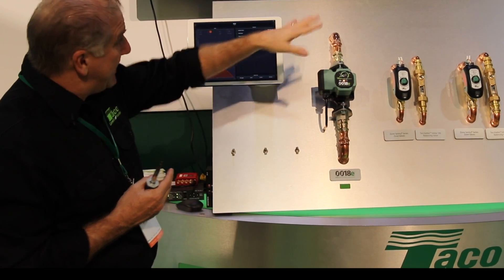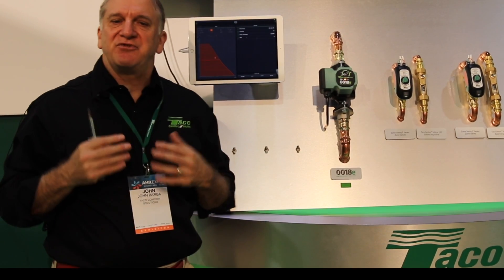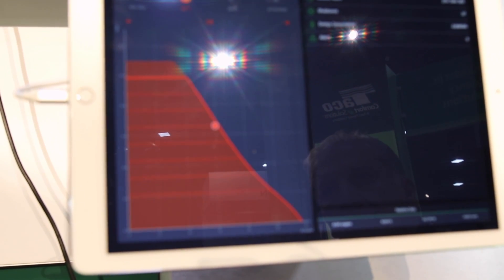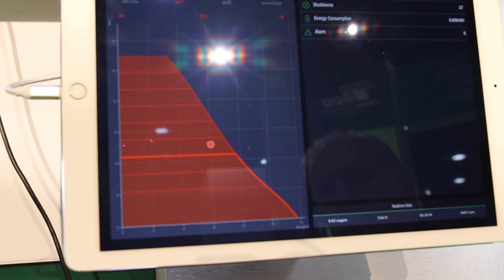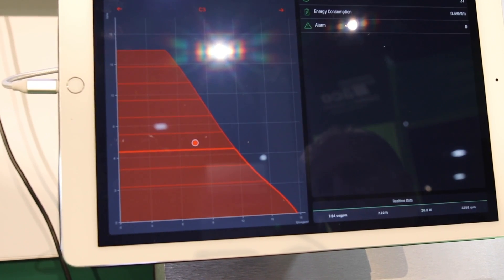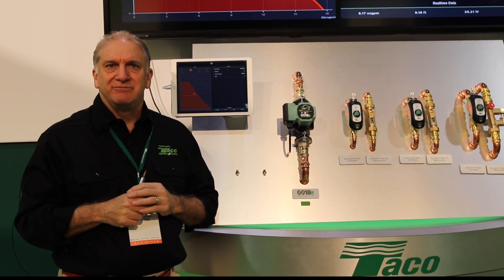Right now I have about a little over seven gallons a minute at right about eight feet of head — that should be just about right. If I need to bump it up, I pick the next setting. We've picked a higher pressure differential setting and we're at about seven gallons a minute at a little over eight feet of head — probably the safer selection. For the first time, this allows us to actually see what's going on inside the pipe, see what the system is doing in real time with real numbers. We can fine-tune the circulator to maximize system performance, maximize boiler efficiency, reduce short cycling, and have the system set up to work like a champ for many years to come.